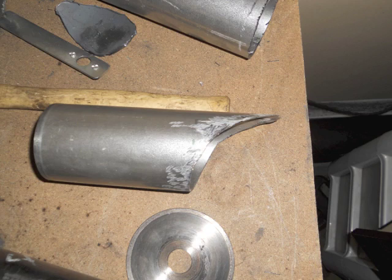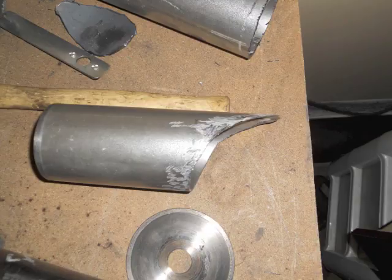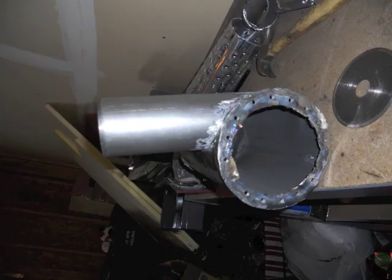Now this is going to take a lot of test fitting and trial and error, so you just need to shave down a bit and then hold it up to your combustion chamber, and you may have to go back and shave down more. After you get it to the right dimensions, hold it up to your combustion chamber, take a marker and trace around it, then just take your angle grinder, your jigsaw, whatever you're using, and cut that hole out as best as you can. It wasn't very easy for me, but just be patient with it. After you get that taken care of, go ahead and weld it on in the exact spot.